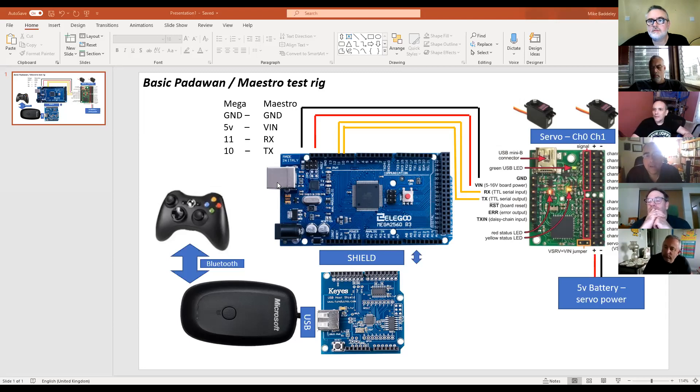If you don't already have your main Mega 2560, you can get an ADK or an ADK clone, which has that USB port built onto the main board. They're a little bit more expensive and the official Arduino ones have been discontinued, but the clones work more or less every time. Do they work with the Padawan sketch? I know they work with Shadow. I believe they work with Padawan as well, and the Padawan 360. That's what I've got in my R2 right now - the Mega ADK.